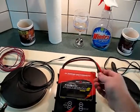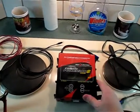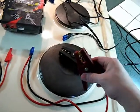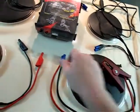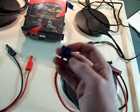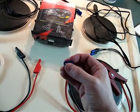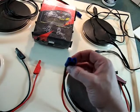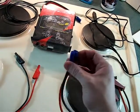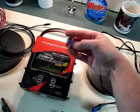This connection is actually the power lead and how you get power to this unit to make it go. It comes with, by default, a couple of alligator clips. You put these on a big old 12-volt battery and you plug in this special little connector — positive is on this side, the non-circular plug, and the circular one is the negative. That just plugs into this side on here.